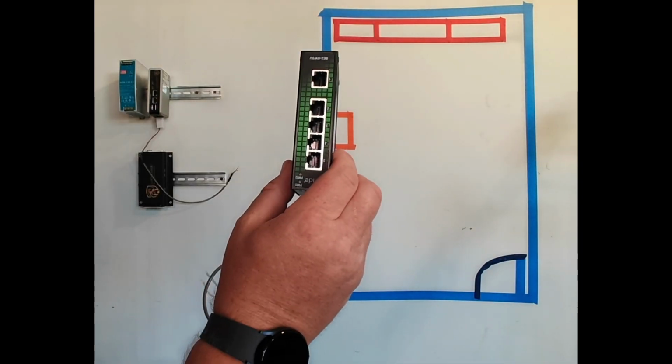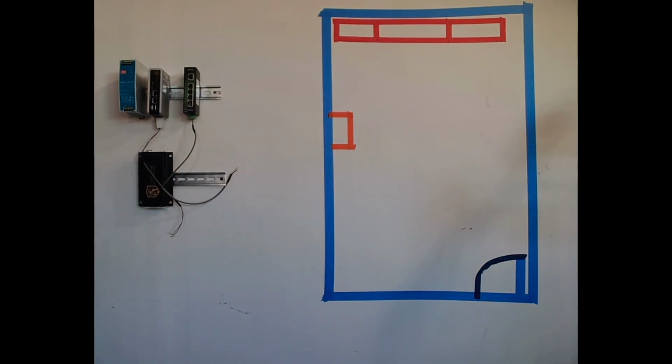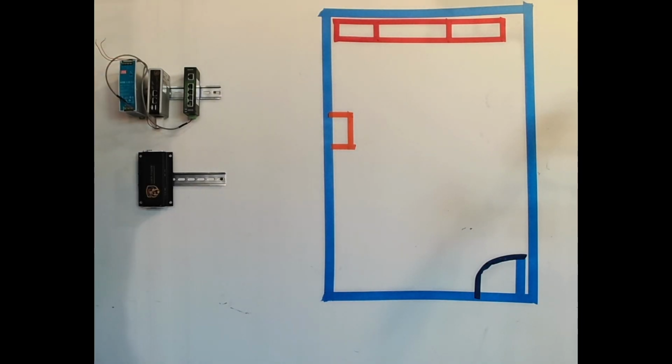So this is where we're at. We've got our switch. It's going to go up here on our wall, just like snap track right in place. So we've got our power supply stuff here. We're going to route these up, and we will dress them up as good as we can. And then we will get one more power supply in here to our hub, which will come up and land here. And then we're going to start with the Cat 6. So the wiring that you're going to want out from here is going to be Cat 5e or Cat 6. I would recommend just going with Cat 6. That way there's no confusion of which cable is out there, just in case somebody tries to get in with a lower cost cable.